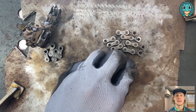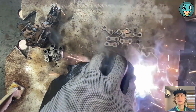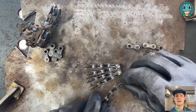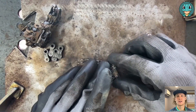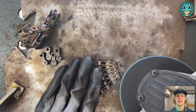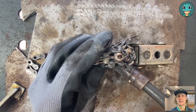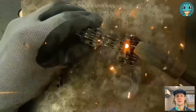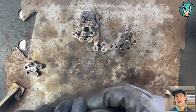The next part is going to be making the tail. This is made up of six six-linked pieces, and pretty much I'm just stacking them all so that the bases are aligned, then spreading them out. They naturally do that because of how the chains are made, which is nice. Then going through and just making sure they're all secured and cleaning them up before adding them onto the body. I'm going to buzz that magnet out, hold it in place, and then quickly tack them and go back through and add all the extra securing tacks. Then just tap that tail down.